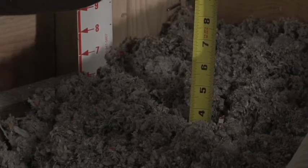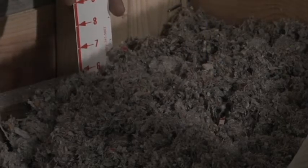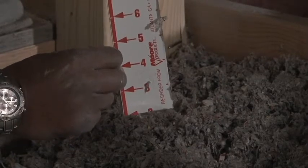My tape is saying four inches, even though the attic ruler says six. Why is that? As we take a look at the attic ruler, we notice that the bottom two inches have been cut off. This is a technique that unscrupulous technicians will use to save on materials. Something else a technician may do to cheat is to turn up the air setting on their blowing machine, which fluffs up the insulation — so right after it's installed it may show 14 inches, but over time it begins to settle. So make sure when you're doing an inspection to check the bag count, not just the inches.